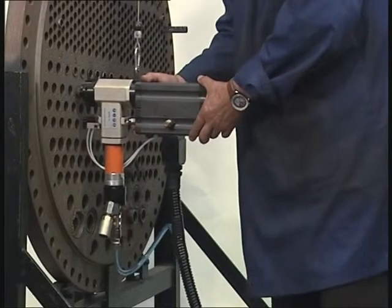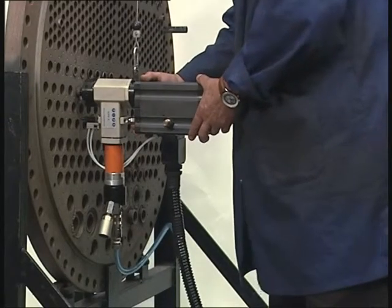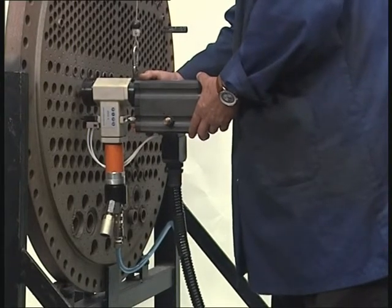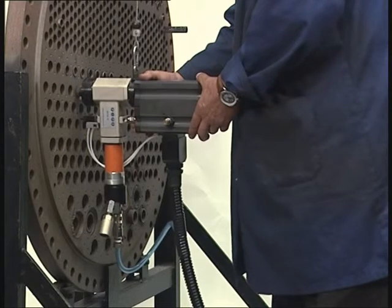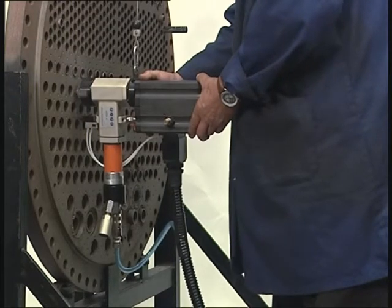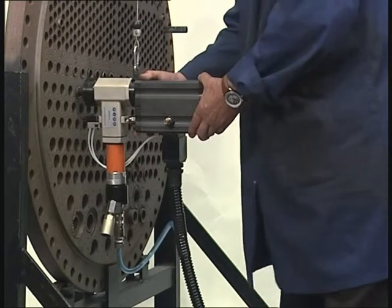The Mini Automatic is unique in the field of heat exchanger manufacture and repair. It is the only machine designed for automatic tube end facing, seal weld removal, and the J prepping of the tube plate, which can be achieved simultaneously using the correct style of cutters. It requires very little operator assistance.